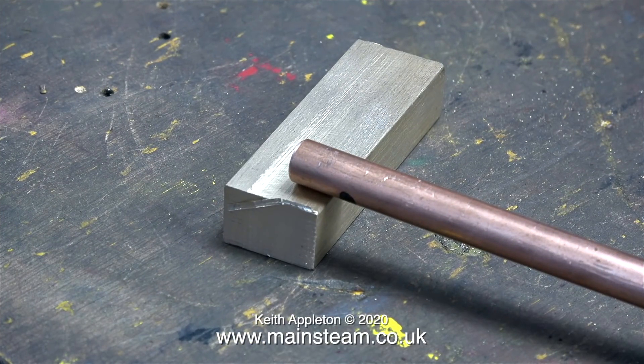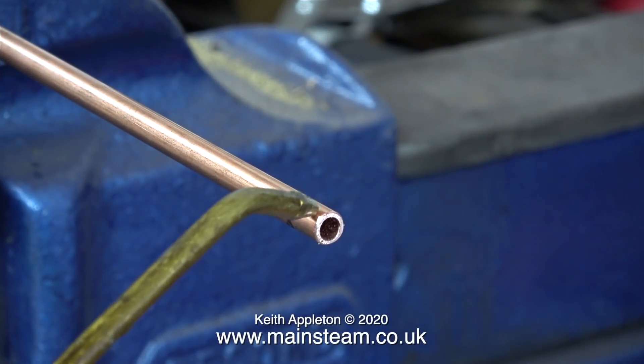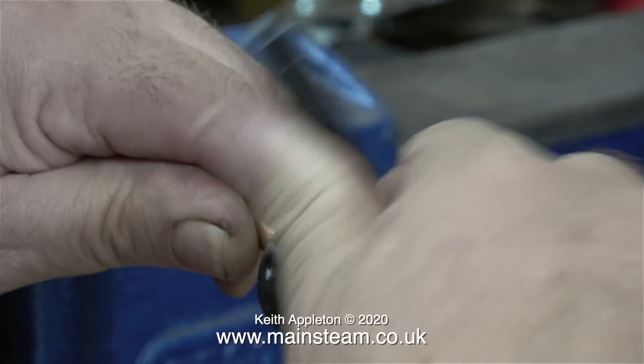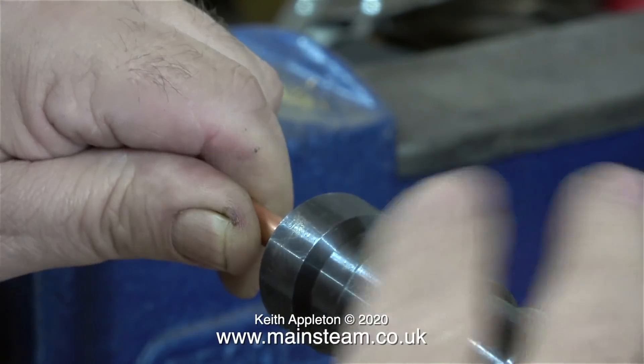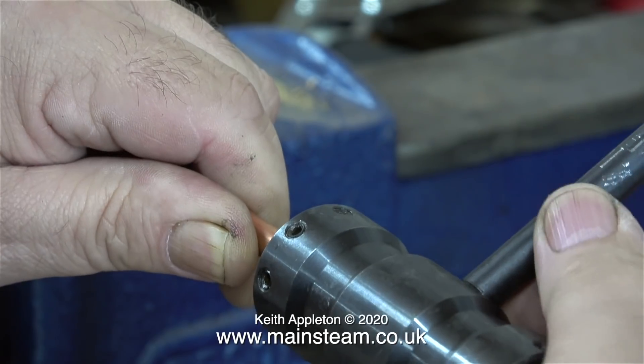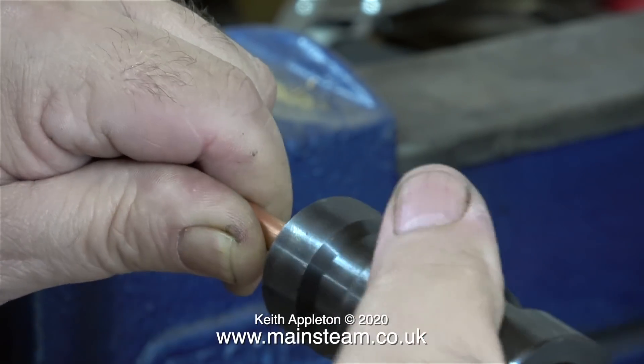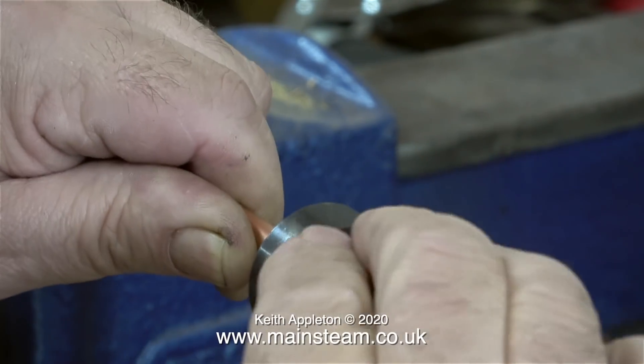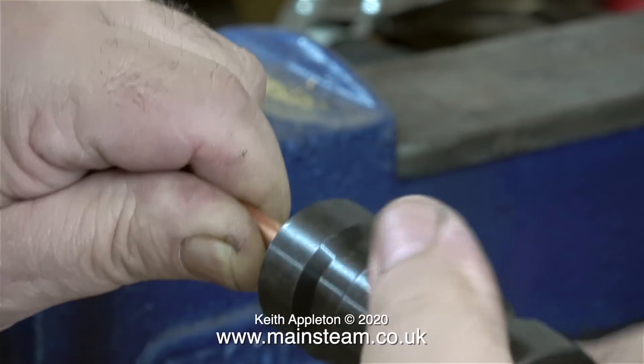Using a small piece of cast gunmetal which I've partially machined, I'm going to make a fitting for the end of the two tubes. Eventually I will be silver soldering the two copper tubes into the gunmetal block. But I don't want to rely just on a silver soldered connection, so I'm going to use a threaded connection. Using my tailstock die holder, I'm cutting a 5/16 by 32 threads-per-inch thread on the end of this first tube.